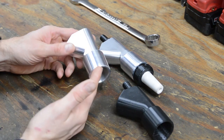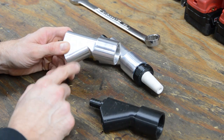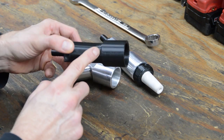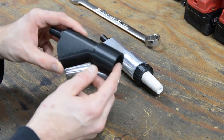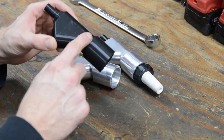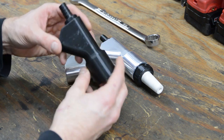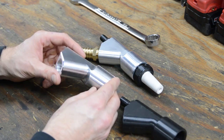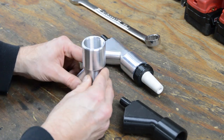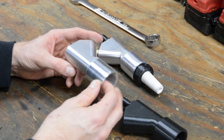So here are the first aluminum samples from the vendor. The reason I'm doing this video is this piece looks a little different than the 3D printed part in this area right here. On the 3D printed part it's nicely blended, but you can model anything you want and print it — actually manufacturing it is a whole other story. I knew this area would be challenging because you're going from a round to an oval. The way they did this is they have it set up in multiple passes, and the last pass comes in like this to mill. This was done on a 3-axis machine.